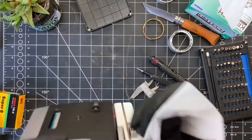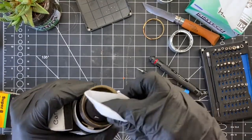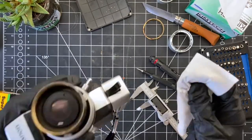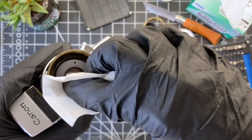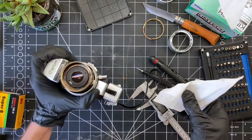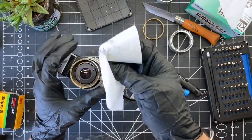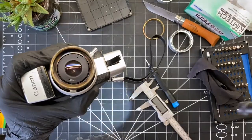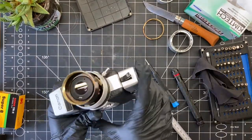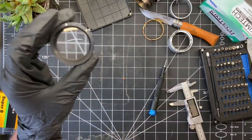I'm going to use some Kim wipes to clean out these lenses. These are available on Amazon, they're very cheap, and they're actually used to clean optical equipment so they won't leave any scratches. To clean the lens I'm simply breathing on it and then rubbing in small circles with the Kim wipes. I noticed after wiping it down that there was actually a fair bit of grease on the inside of the focusing ring, so I cleaned out the grease around the outside perimeter of the threaded focusing ring. Once that looked good I set it aside and started focusing on the outer lens assembly.